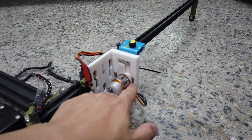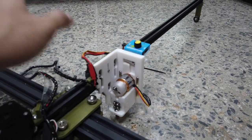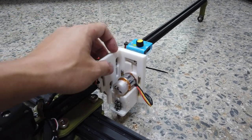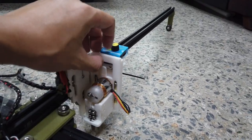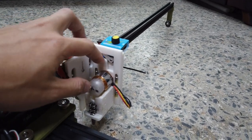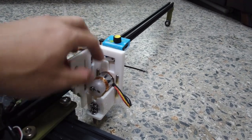While you build this, make sure you put grease in the slot over here — it makes a huge difference. Without it, maybe it's not smooth enough because seriously it was using gravity. I just added a mechanism here to make sure it's always pushed down.